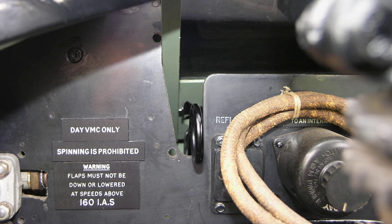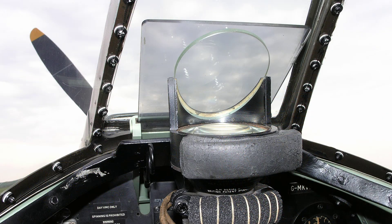This is the lifting ring for the sunscreen. When the gun sight is used during the day and the background of the enemy target is very bright, a sunscreen can be slid behind the windscreen by pulling on this ring at the top of the instrument panel. Here is a look at the actual sunscreen — notice the lifting ring is now up.